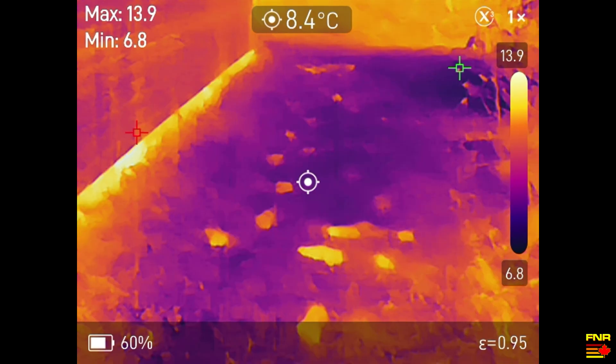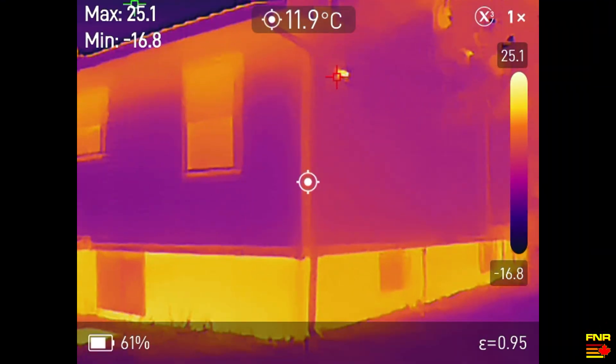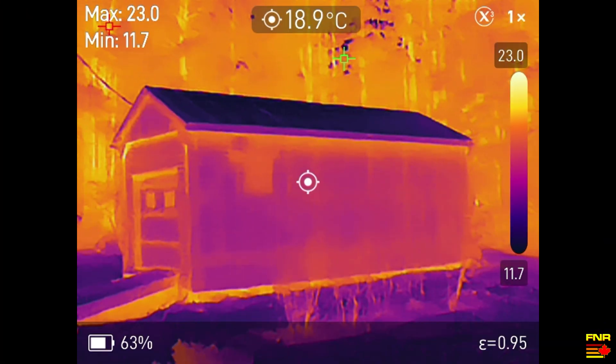In this picture, I walked barefoot across my lawn, and my footprints are visible in the grass. They don't last very long as the heat dissipates, but that brief moment of contact was enough to show my footprints. As a more practical use, gaps in home insulation can be found the same way. If your winter heating bill is too high, scan the outside of the house looking for hot spots, and you can directly see where heat is escaping due to missing insulation. Here is a picture I took of the outside of my new shop — it's insulated, but I have a spot framed through a window I haven't installed yet, and that uninsulated space shows up right away on the thermal camera.